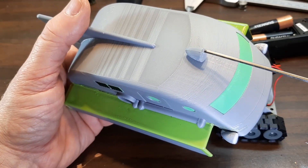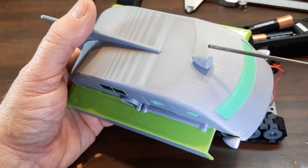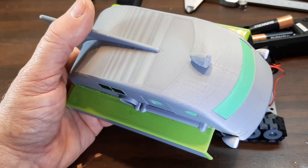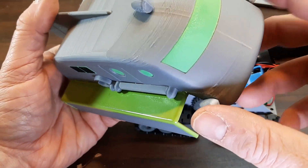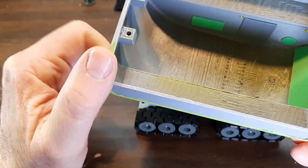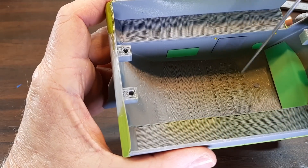These lights print in two different halves. There's a separate file for the side lights and the top light, and there's also a hole on the side of each one for a locating hole for a piece of 1.75mm filament for alignment purposes while you're gluing it together. Then they're just glued in. Unfortunately this is all printed with support.